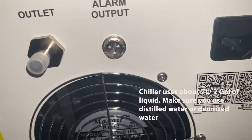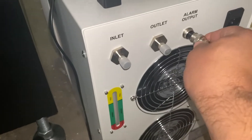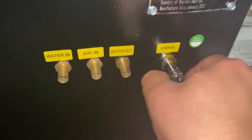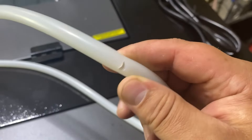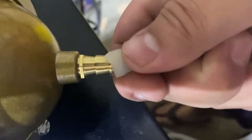Setting up the chiller: the first one is the alarm — three pins on one side, four pins on the other side. Just line up the notch, you'll see it on there, line it up and thread it in. For the chiller water connections: the in goes to the out, so the inlet from the chiller goes to the water out, and the water in goes to the outlet of the chiller. It makes sense — you're just circulating and cooling the water. Make sure you check your hoses though; I had a slit in mine so I had to go to Home Depot and get a replacement. It's a little tight but it still went on.